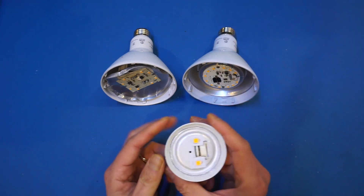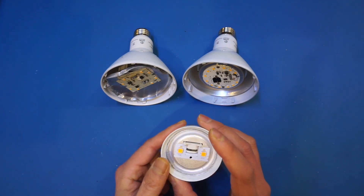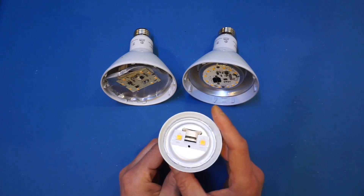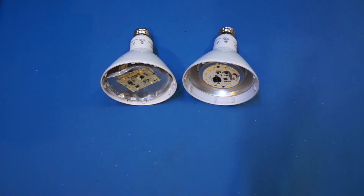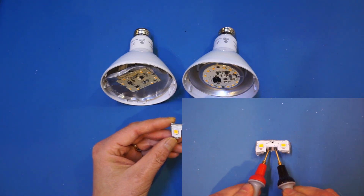As you can see, it is quite compact and this is certainly not sufficient for heat dissipation. The most likely failure is due to the mains filter cap inside either bulging or drying up under these high operating temperatures. But the LEDs themselves are actually all functional, and in fact I had saved all of these LEDs — I cut them out thinking that one day I might be able to use them.